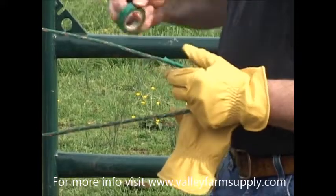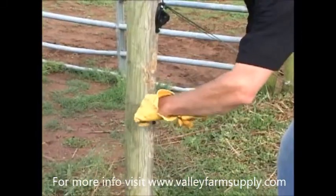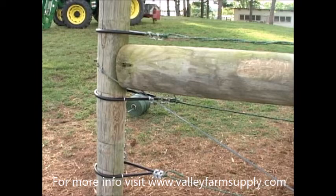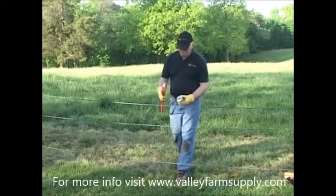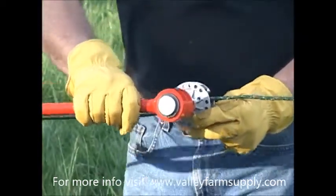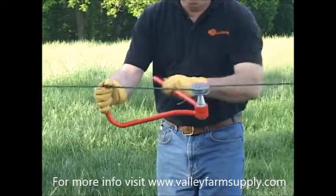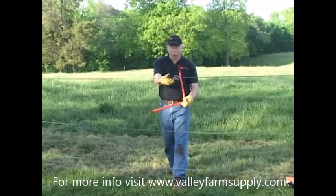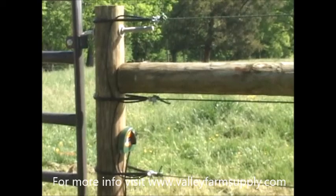Just mark your post, drill your hole, and screw in your lag bolt. Attach the insulator with a nut. Repeat this process with the other two corner lag insulators. We have installed Insultube at this end as well. Roll out your wire from one end to the other. At the opposing end, wrap electrical tape around the Equibraid to prevent fraying and cut. Repeat the same process as before to secure your Equibraid. Walk back through and secure the Equibraid in your insulators. Make sure that your Equibraid is far enough away from the twitch wire to prevent a short. If necessary, add a staple as shown to offset the wire, taking care not to kink the tubing. Place the groove in a rapid wire tightener over the first strand of the Equibraid.